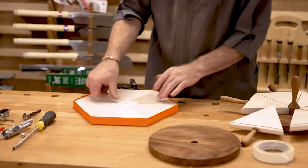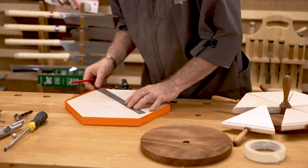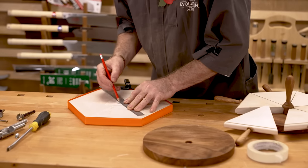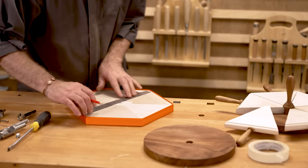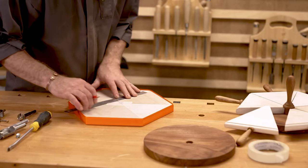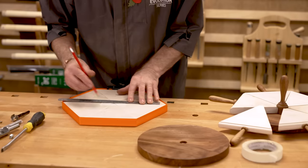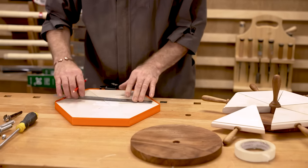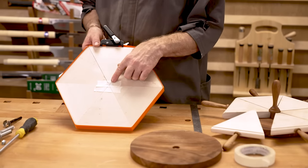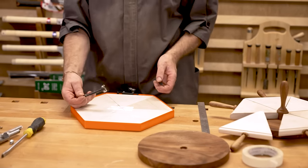A little bit that side. Let's go to our ruler. Let's draw a line. Going to extend from the join points of where the boards come together. There. Most of you might be able to see this quite a bit. It'd be good if it's nice and accurate. So that will just get me back to something where I can actually see my middle accurately and make sure it's going to work. Next thing, just going to put the drill bit in the pillar drill.